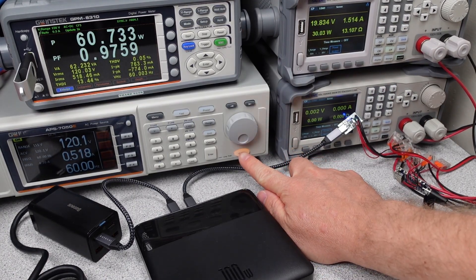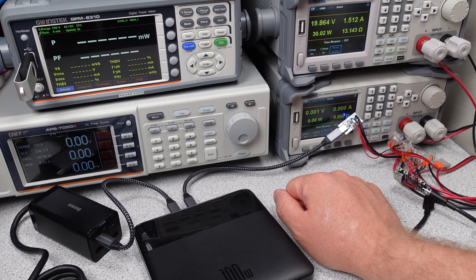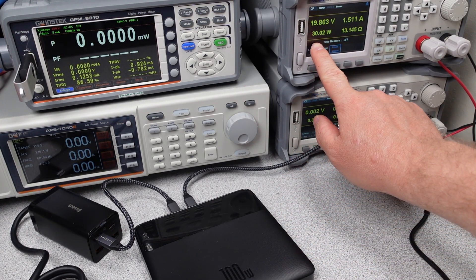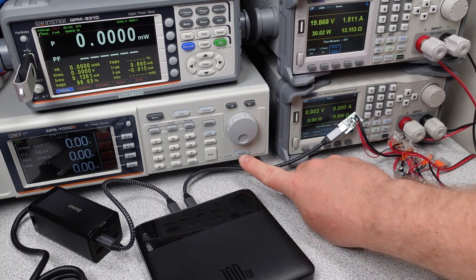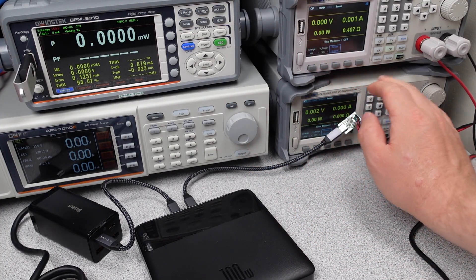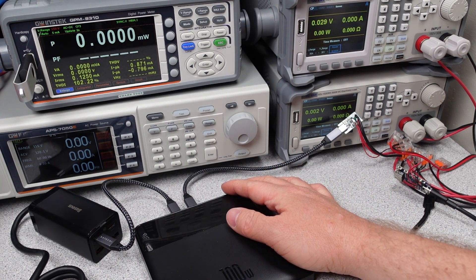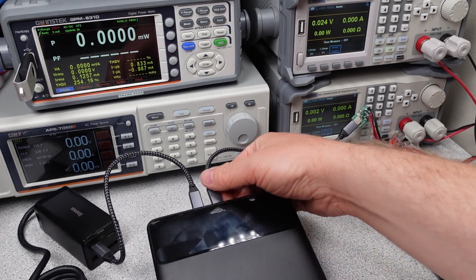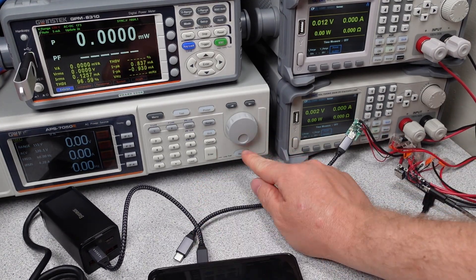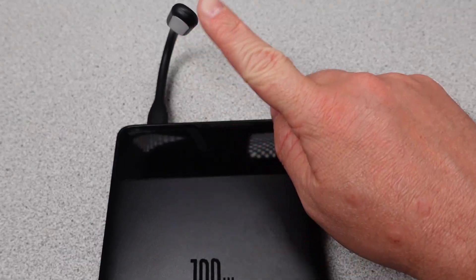The device does work while passing power through the power bank, so charging at 60 watts and passing 30 watts to the output in this case. If you power down the input, though, the device does shut down, so this means it is not suitable for an uninterruptible power supply, which it isn't intended to be. The voltages all stay within the tolerance of the USB power delivery specification, which is nice to see. This device does have an always-on output voltage, but you have to enable this mode. If the load is light enough, the device will turn off the output after a few seconds, though any new plug will turn the device on.